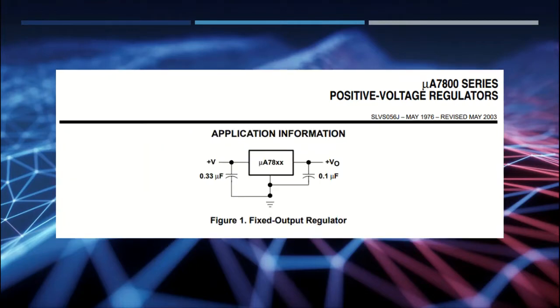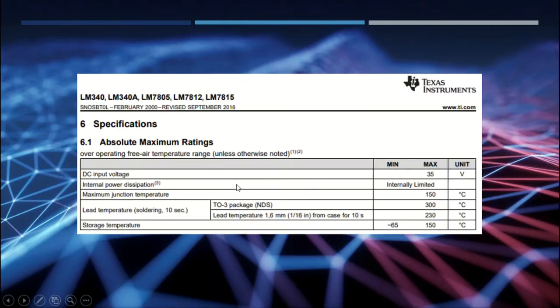Now, given that I can use that, I'll go ahead and look up the circuit that I'll need to set up for that 7805, and according to the data sheet that I found online, I'll need to set up a circuit very similar to this right here. Okay. All right, second, remember we have to power the motor also.